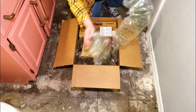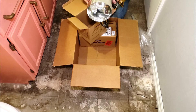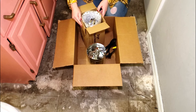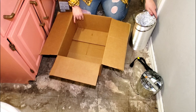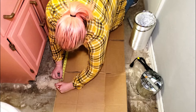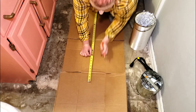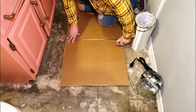But before I started painting, I needed to set up my ventilation system. Unfortunately, this bathroom does not have any windows, so I don't have a good way to vent the fumes out of this room. To solve this problem, I ended up ordering a six-inch duct fan and a 25-foot long vent hose. The closest window to this bathroom is in my bedroom, which is one door over. So I'm going to run that hose out my bedroom window so it'll suck all of those fumes out of the bathroom and push them outside. I used the box that everything came in to create a little panel to attach to the window — once I had the cardboard marked to fit the width of my window, I just cut it down to size.